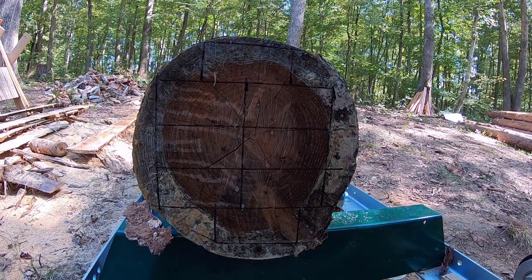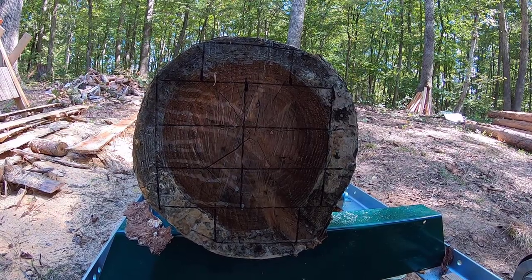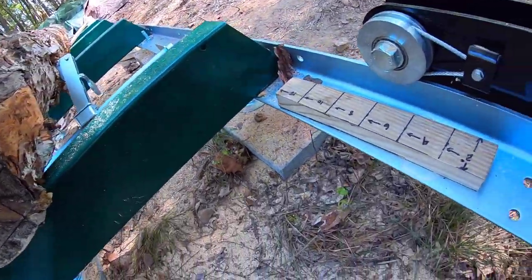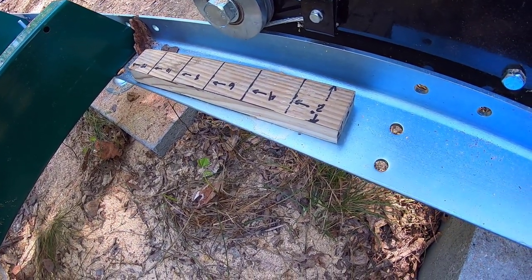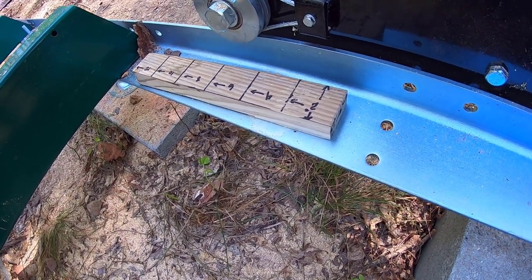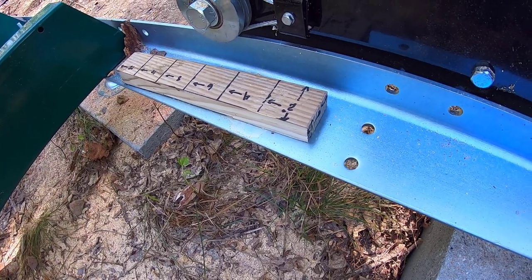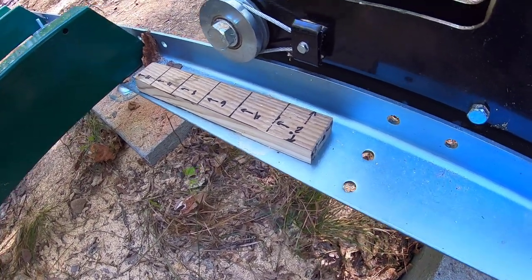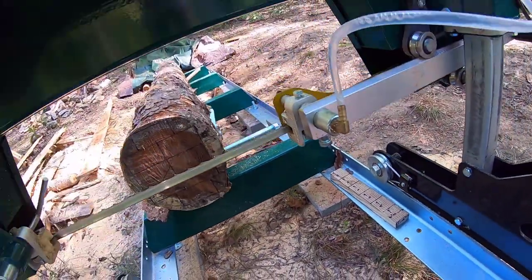This is clearly the hardest part — figuring out how to get the lumber you want out of a log. I've got some ideas of how to make this easier. For now I'm using this stick idea, where I've got a 2x1x12 inch board that I've marked up so I can figure out how to mark things a little faster. Most everything on a cut is probably going to be 1 inch or an increment of 4, so hopefully that will work out well. I've got a tape measure if not, but it's just a fast way to draw all the lines.